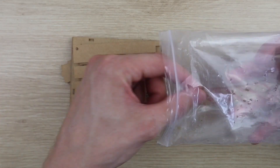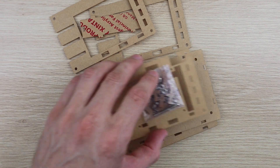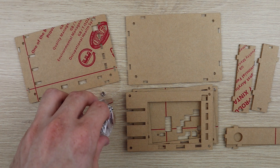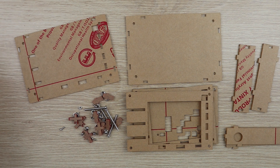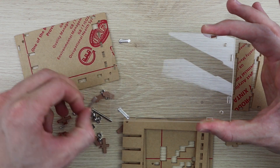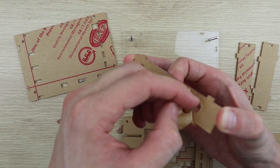I then got to work putting the oscilloscope into the acrylic case. I found the case to be a bit frustrating. It is quite well built but the clearances around the components are found to be too fine. If any of the components are even a little skew, as was the case with my power socket, the surrounding plate didn't fit. This led me to crack the right top corner of the first inner plate, which didn't really affect the rest of the assembly but it is noticeable. There is also not much headroom above the components — if any of your components are not completely flush with the PCB then you'll probably not be able to install the inner three plates properly.